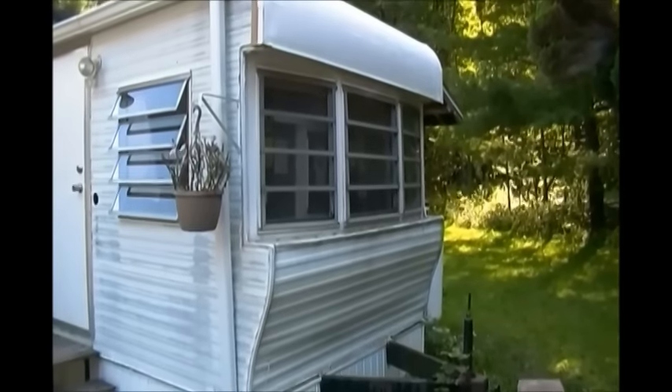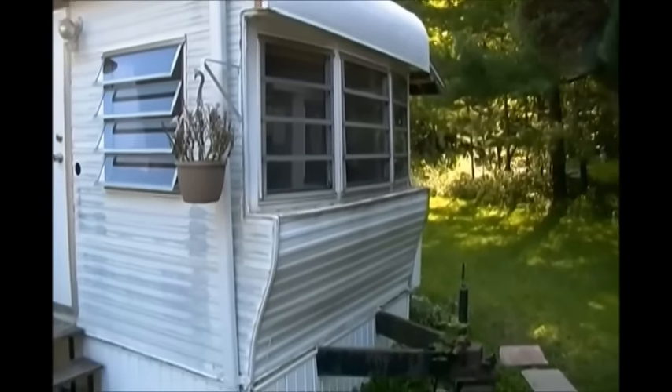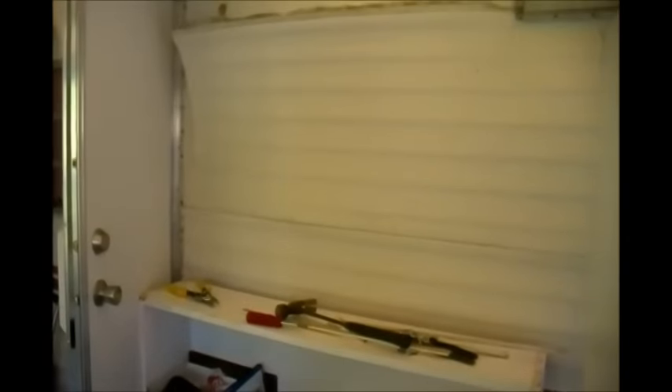I spent some time trying to figure out what I'm going to do with the siding between the windows. I could buy vinyl siding and put it on there but it wouldn't match the aluminum. Then I realized I've also got a wall inside the sunroom that eventually I'm going to be adding two-by-twos and more insulation and covering that whole wall with Luan. So what I'm going to do - I've already started - is take this aluminum siding off of this wall and then I'll be able to use that to go around the windows on the outside.